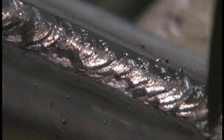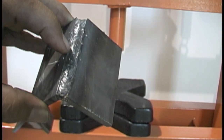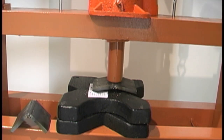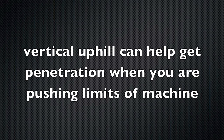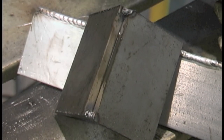This is quarter-inch material; the machine's only rated for three sixteenths, but you can see evidence of penetration coming through the corner. That's not a full-strength weld though — I've got quarter inch with probably not much more than an eighth inch of weld thickness, even though it's filling that whole groove. That first one didn't impress me at all: only about four or five pumps with the handle and it gave right away. Sometimes vertical uphill can work a lot better, so I'm going to position this one almost straight uphill.